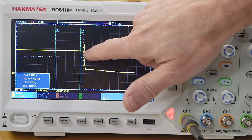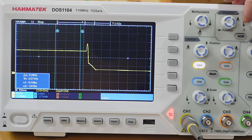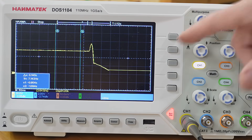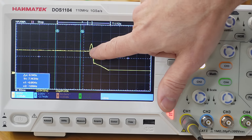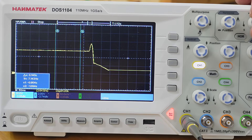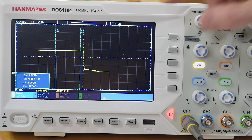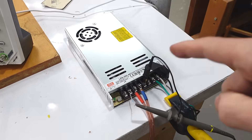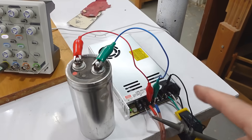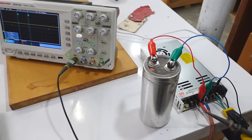This is where the throw happened — after accelerating my lever it had to slow it down, and the controller just sends all the energy back into the power supply, which caused the voltage to go higher and made it shut right off. After that, this power supply needs to stay unplugged for a while before it's happy again. I added this capacitor to stabilize the voltage a bit.